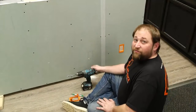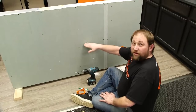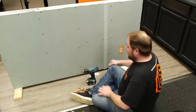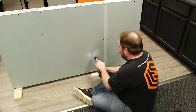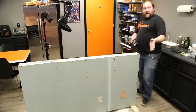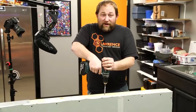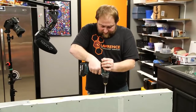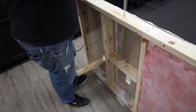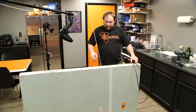With the mud ring installed and the wall fish complete, we move into the next cavity. This is what happens when you start from the bottom — we're talking about that potential of running into a fire stop. We're going to drill our hole at the top of the wall and run our wire through. But we've run into an obstruction — that's our fire stop. This is exactly what we were talking about.